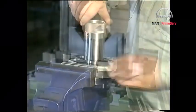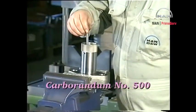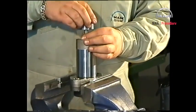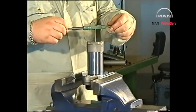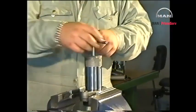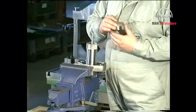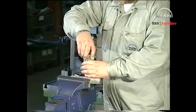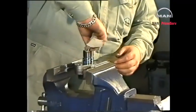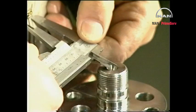Use the milling or grinding tool if more serious damage has occurred on the seating surface for the high-pressure pipe in the valve head. The diameter of the seating surface must not exceed the value stated in procedure number 909 in volume 2 of the instruction book.